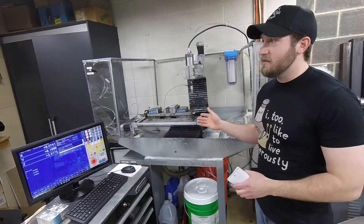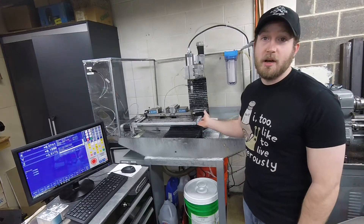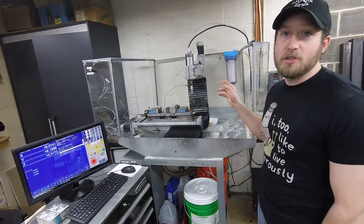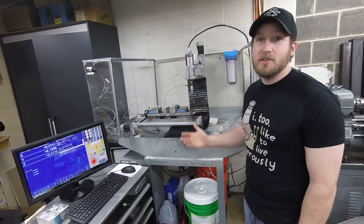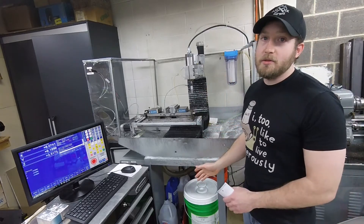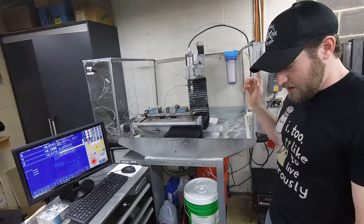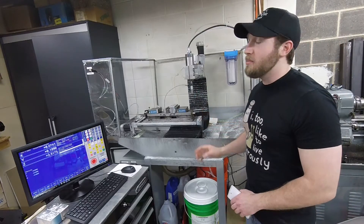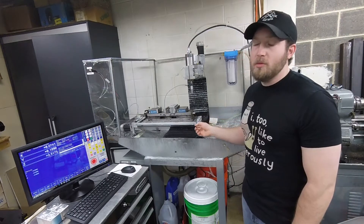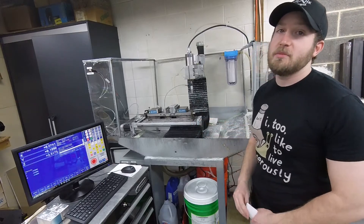I went from about eight inches of movement on X and around four and a half on Y. Now I run 16 inches on X, 10 and a half on Y, and nine on Z. The Z axis is a three horsepower water-cooled spindle — just one of your Chinese router 8,000 to 24,000 RPM spindles. It has ClearPath servos on all three axes: NEMA 23s with 6400-bit encoders and 620 inch-ounce output. I'm also running Home Shop CNC C7 ball screws, with NSK C5s that will eventually be upgraded in.